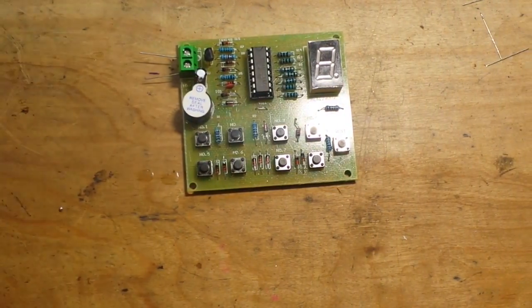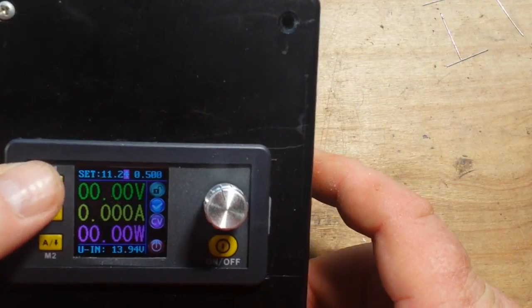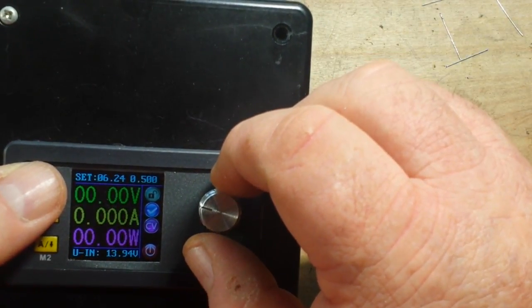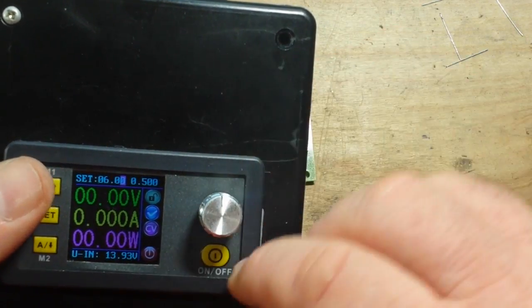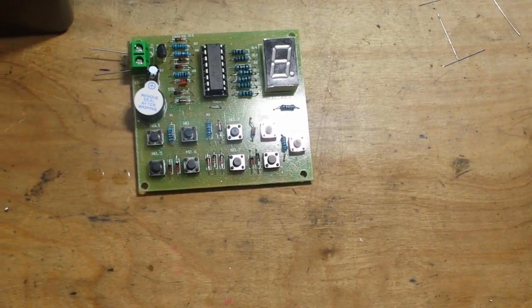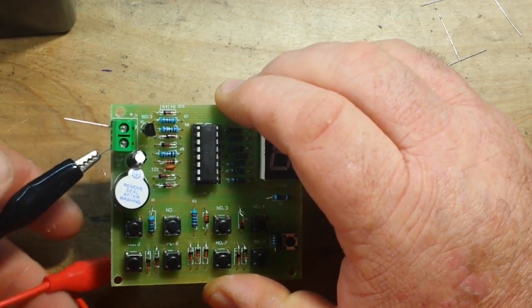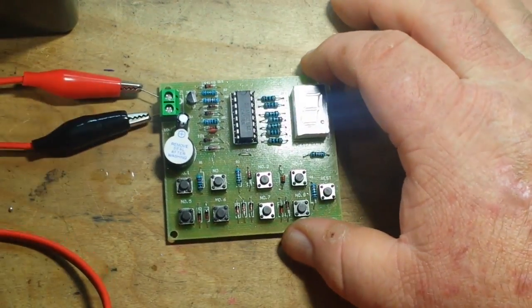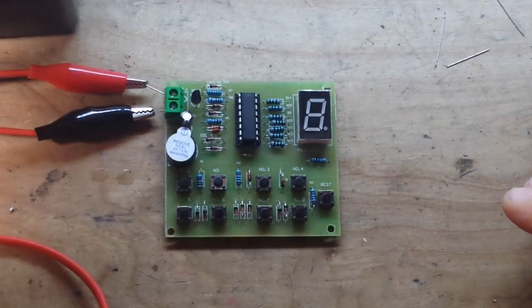So, 5 to 8 volts, that's what I wanted to know. So we'll bring in the power supply here. We'll take our voltage down to 6 volts. How's that? Seems safe, right? Then we'll hook it up. I'm believing this is the ground and this one is the positive. And if I'm wrong, we will certainly know soon enough. Okay. Power's on.